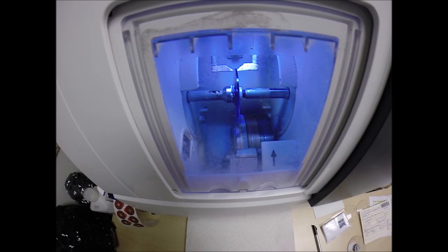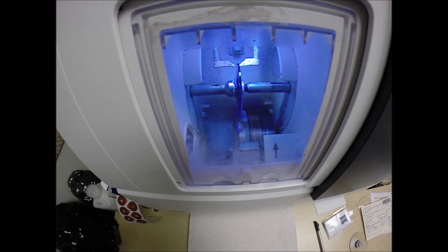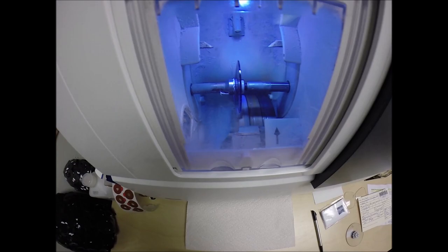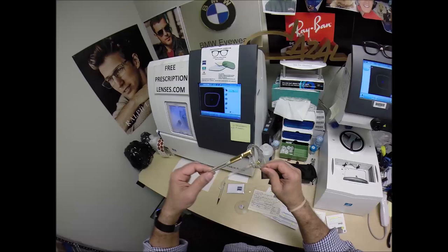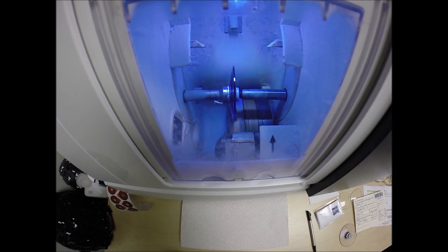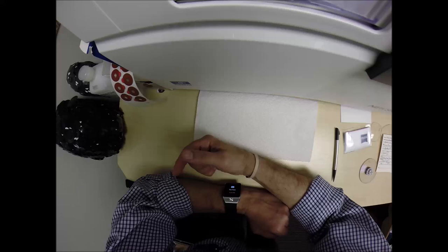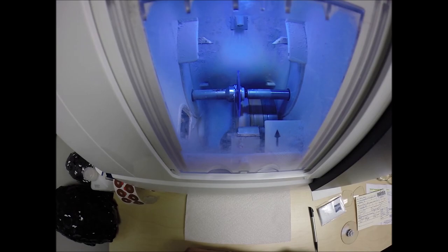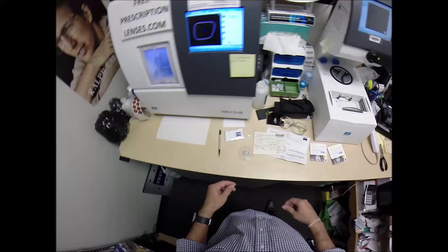The stylus is going to trace the shape of the right side of the frame, making sure it's large enough. Measure twice, cut once. It's measuring the thickness of the lens at every point to know exactly and precisely where to place the bevel so you have the least amount of edge thickness showing — of which you will have none in this frame, because you have non-prescription distance power in a thick plastic frame. The water in the background is there to catch the optical sawdust as it comes off the cutting wheel. Polycarbonate lenses are cut dry, meaning no water sprays onto them while cutting, whereas plastic, high-index plastic, and trivex cut wet — meaning water sprays onto the lens while it is cutting.